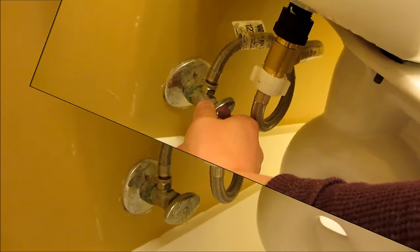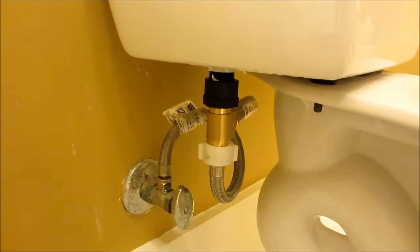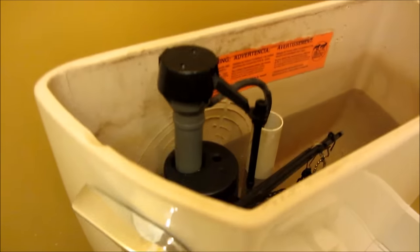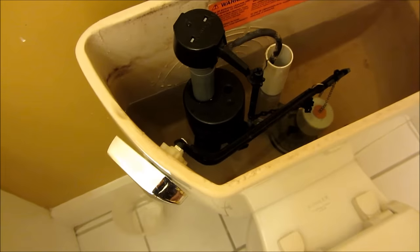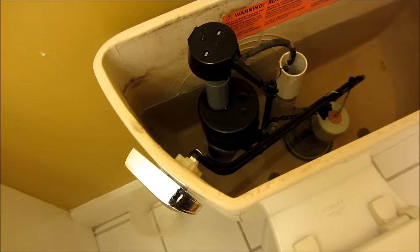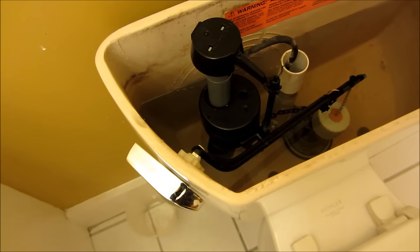Notice in this next scene when I open the water valve that there is no vibration. What I ended up doing was closing the cold main water valve, and then opening all the cold water faucets in my house, to either clear the air from the pipes or to equalize the air in the pipes.